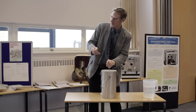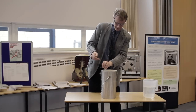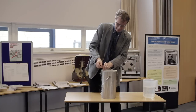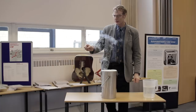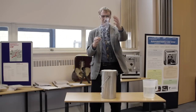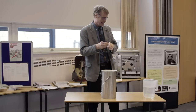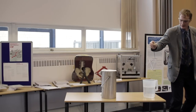So now in its low temperature phase, I can deform it like I did before. I can now take it out again, but this time I'm going to try and heat it up quickly, because before it took a while to heat up. Obviously, there's a lot of energy stored in there, because I put a lot of energy in to deform the material into its new phase. So I'm going to drop it in — I'm going to stand a wee bit back, because it's going to go like crazy.